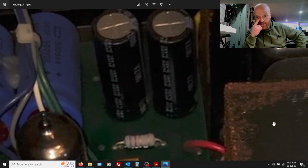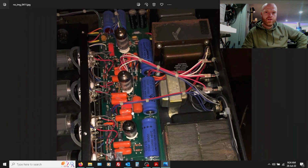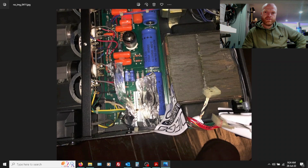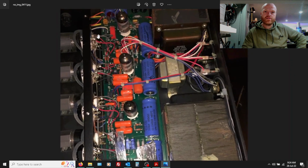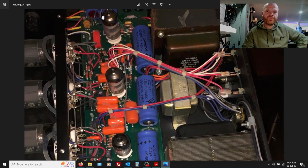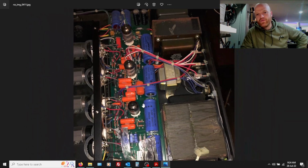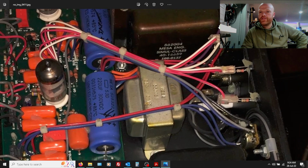And you can see up the end there, those two caps, those two radials that form the two sides of that filter for the switching matrix. Which is a little bit complex considering this is just a power amp, and there's not a lot of switching going on. They could have just used a dual pole, dual throw switch probably, but anyway, moving on.